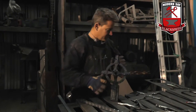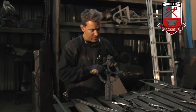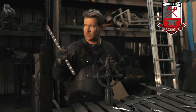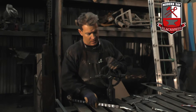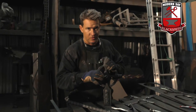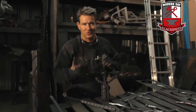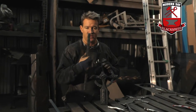Now I have all my components for the cross — everything's getting welded up, forged, everything's going in the forge to give it that old world look. Now I need the standoff for the actual candle torch to stand. I'm a big component of reusing material, so I'm going to use some of this three-quarter solid hammered bar, put a twist to it, and weld it to the cross itself. I have a two inch candle, so I only went about two and a half inches out. I'm going to heat up this bar and give it about four or five twists, then cut a section that I like.